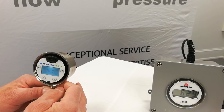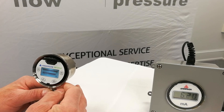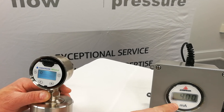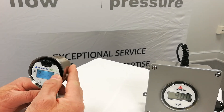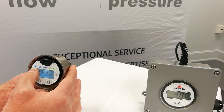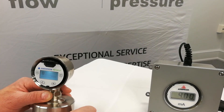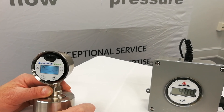Now the system is going to reconfigure itself, and when it's done we'll see our output change and our new units. Now I'm sitting at zero PSI. I can see my bar graph is all the way at the bottom and my milliamp output from my sensor is at four milliamps. I can add decimals by using the up and down keys to add more or less decimal positions. These parameters are the bare minimum necessary to configure an L3 if you don't specify your range and output units when you order it. Thanks for watching.